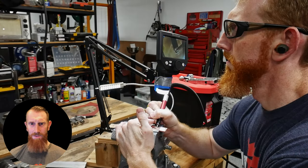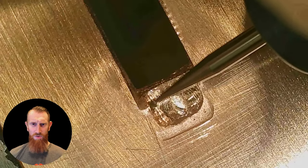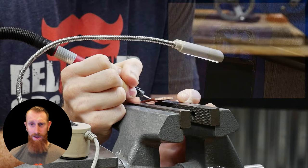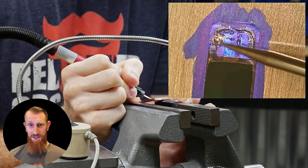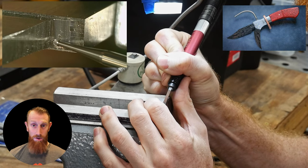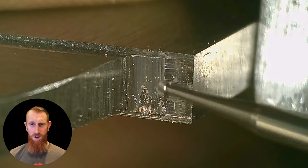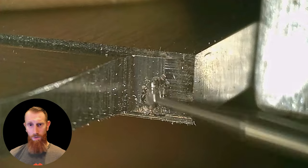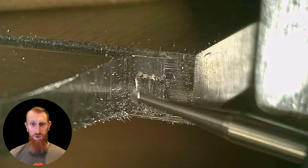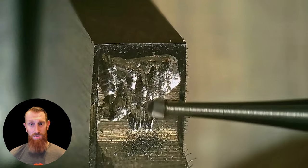This fitting style is a tedious procedure in which the maker removes material from the guard in order to recess the ricasso into the guard, thus preventing any gapping. You can also see me use a digital microscope and rotary burr in my recent fantasy knife build, where I did the reverse of the Kyle Royer guard fit and actually removed material from the ricasso in order to fit my blades into the center hub. While I got the job done, the picture clarity on the screen isn't terribly sharp, which is critical for seeing what you're doing on this tiny scale.